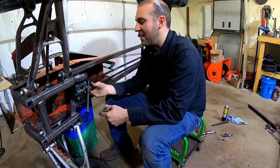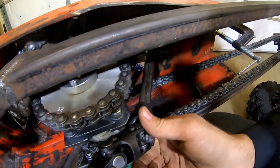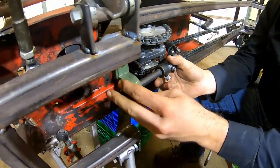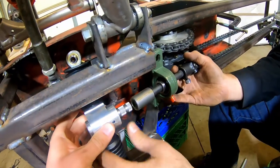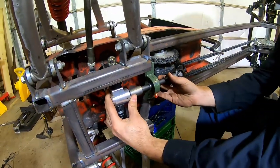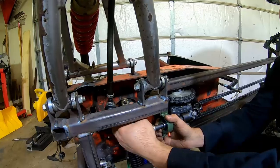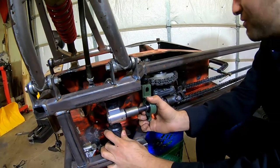We're working on getting the shaft to where we're going to put the rack and pinion. We just cut the shaft to length and we're going to put this double knuckle U-joint here - it's pretty close but it clears, so that's good. We're going to put a little bearing here to build a brace behind this. That's kind of where the rack and pinion is going to be. We're going to weld in a little piece of metal for the bearing to bolt to - that should hold it pretty rigid. Then we'll make our tie rod ends and modify them a little to go through the smaller hole on the rack and pinion.